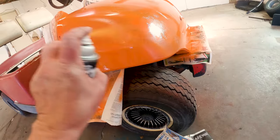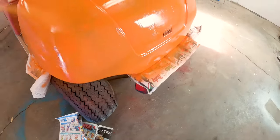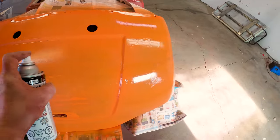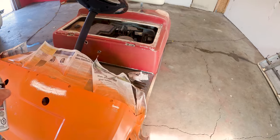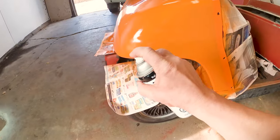Now this is pretty fast to dry, so it's okay to start doing my second coat. This time I'm going to go across so that it helps to fill in the lines that you would have seen as we painted it. That'll help get rid of this tiger stripe look that we've got going on from all the different colors of paint this thing had on it before.